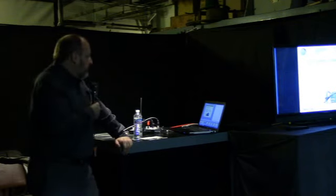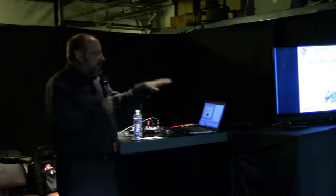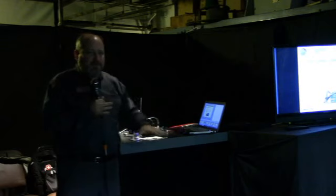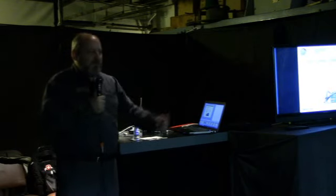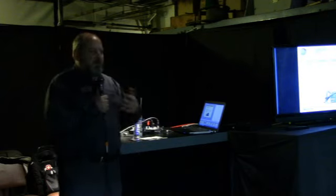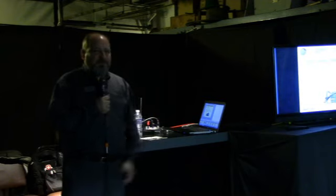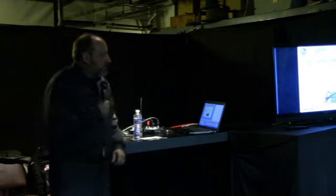The interesting thing about it is it uses a standard RJ45 connection, so it looks like a network. And it's a very dumb device. It doesn't do anything special. You get two of these radios, put them on the same frequency, put them in the DD mode, and they talk. That's all there is. So you plug in stuff and data goes over it. It's basically just an internet cable without the cable. It's a wireless bridge at 128K baud.